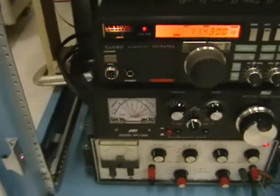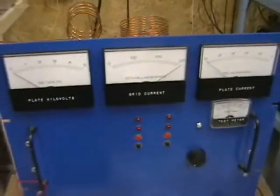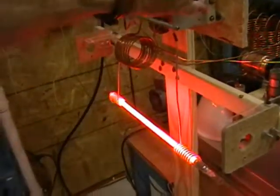The 747 is now putting out power. The meter shows we have power. We tune it for lowest SWR and maximum power into the system. Now we go up here and look at this meter — it is reading full scale. We have adjusted this correctly. Now we adjust the tuning knob on the capacitor until the tube lights, adjusting for maximum brightness.